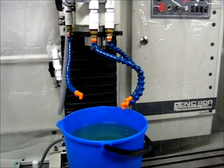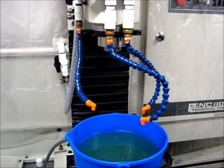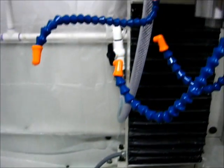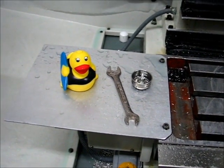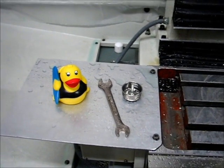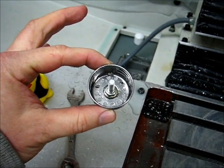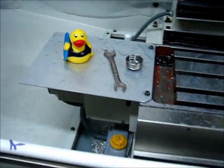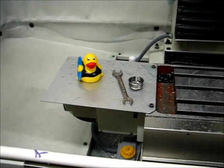I've finished all the tests for three nozzles and I'm ready to move on to getting a statistically significant sample size for the rear nozzle. I've done a bit more testing running the nozzle straight out into the chip tray, and I discovered that the flow back into the reservoir wasn't fast enough to keep up with the nozzles. I assumed the strainer was getting clogged — but when I pulled it out, there were only a few chips in there, certainly none blocking the holes. As soon as I pulled it out, the tray started to empty much faster. So the idea of this additional strainer being in there is not going to work — that's going to come out and stay out unless I'm running something with a lower flow.